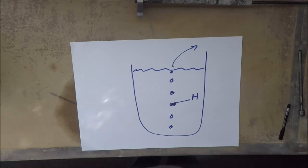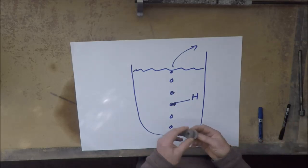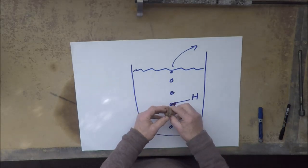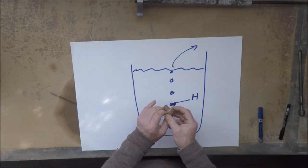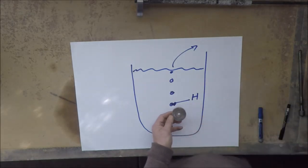Ideally bubble size should be 1 to 2mm. Commercially they use rotary impellers where the gas comes out of a spinning impeller that chops the bubbles up very fine. I've developed an alternative technique using a static lance that seems to produce very fine bubbles. I started off making them quite small — the gas goes down here and comes out through little slits, with the parts bolted together to almost close the slits off. The slits are actually only about five thousandths of an inch deep.